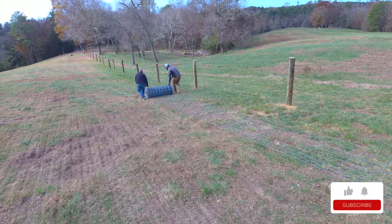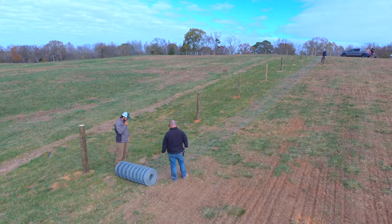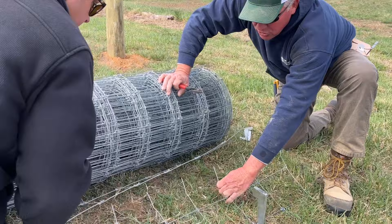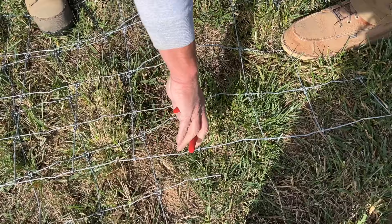The first step is to position the roll of wire so it's ready to roll to the other end of the fence, then just start rolling the wire down the hill until you get to about the midline of the fence. At that point we're going to stop and pre-strip our roll of wire. Here we have our wire staked down preventing it from rolling itself back up the hill. It is high tensile wire — it's very springy. You'll notice we've overlapped our fence where we're going to continue rolling it further, and we're getting ready to pre-strip our rolls.